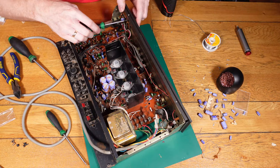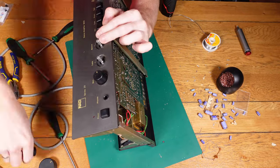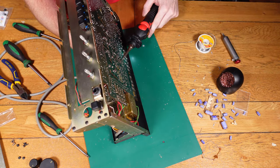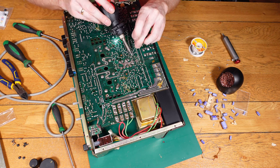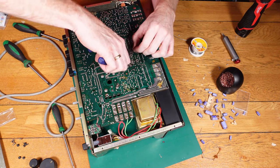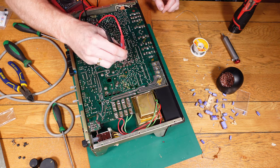As you can see in the video, I'm working my way through the capacitors — removing the old one first using the soldering iron and a solder sucker to remove the solder, then finding the correct replacement part and re-soldering it in and cutting the legs off. You've got to make sure the capacitor is the right way around polarity-wise — negative and positive in the right holes — and that you're replacing each capacitor with the same rating. I always do one for one, taking one out and replacing it, rather than pulling out a whole batch unless I have a diagram or capacitor list to work from.